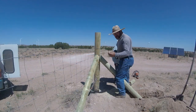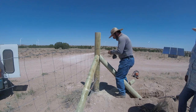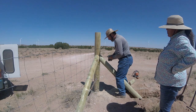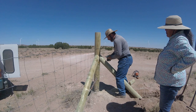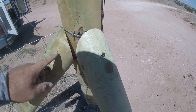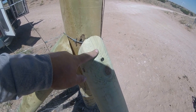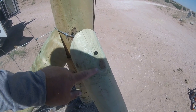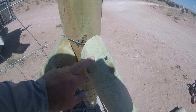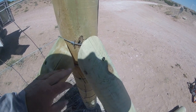We're using a 6-inch timber lock screw, and I really love these things. We have the posts attached with our 6-inch timber lock. These are used in deck construction and log construction — they work really well. In the past, we have pre-drilled a hole and run a rebar in, and that works well too. It's just about as cheap either way. But these timber locks are a whole lot easier to deal with — I don't have to pre-drill, I just run them in.